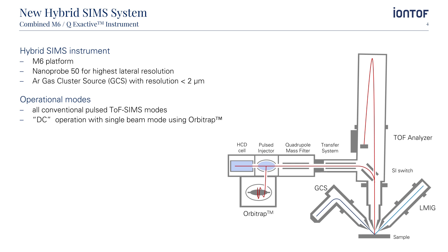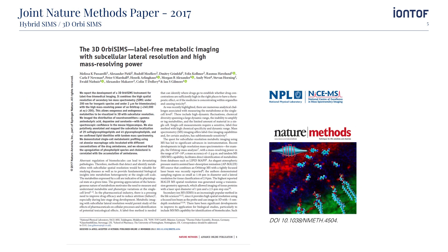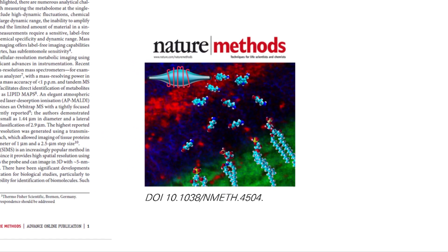It is designed for ultimate lateral resolution imaging, achieving lateral resolutions of less than 50 nm. This is combined with a special version of our argon gas cluster ion source, capable of generating an argon gas cluster ion beam with a diameter of less than 2 microns. In 2017, our development partners at NPL London evaluated the possibilities of the new equipment by applying it to label-free metabolic imaging at subcellular resolutions. In a Nature Methods paper, the different operation and application modes of this new instrument were reported.